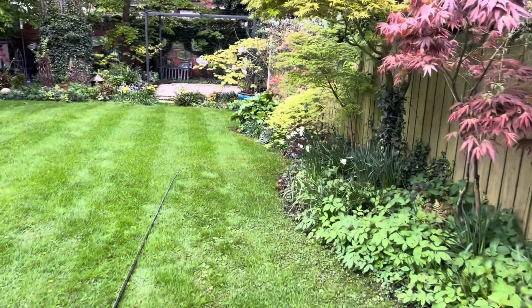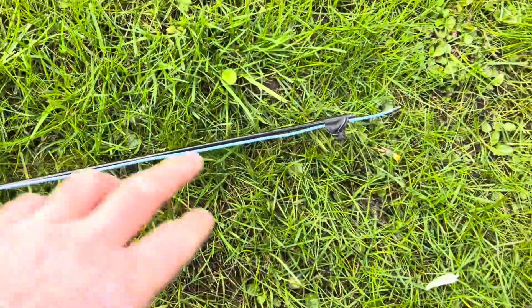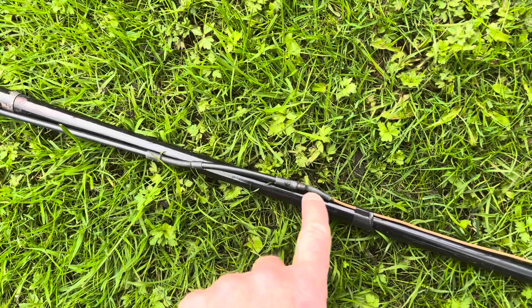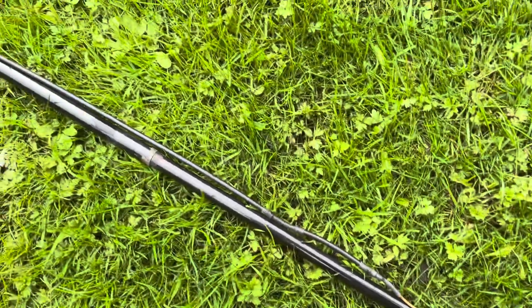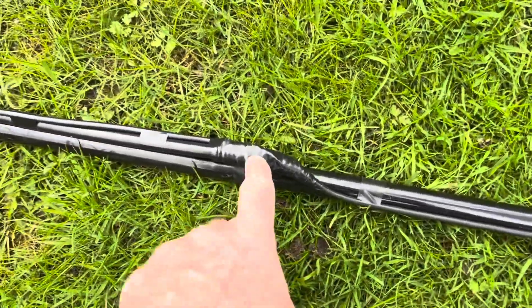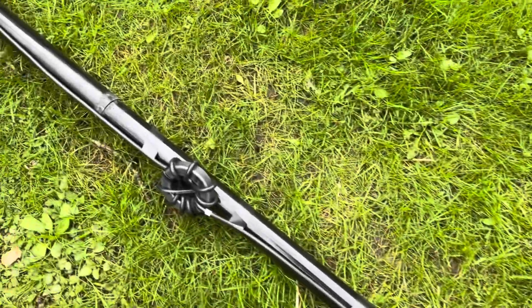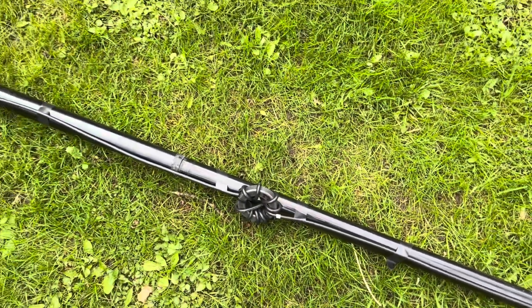One turn, two, three, four through the middle, five, six, seven, eight, nine — and exit down to the PL259. There's our Type 43 nine-turn choke. Out in the back garden — it's still spring, been horribly wet for months. Just temporarily taped the antenna onto the DX Commander expedition pole.